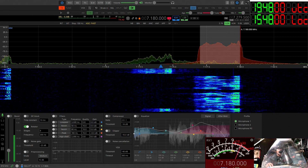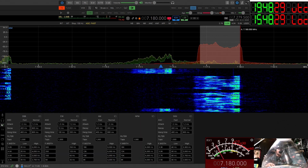I have it on video, but what I don't have is the numbers — you know how you set your audio from 20 to 3000 or 3500 — it doesn't pop up every single number. I'm trying to see if I can change that. What I'm going to do is go into my receive and change it to 3.5 to see if that even comes close. I transmit at 3.5 myself sometimes, especially on 40 meters when it's not crowded — I like to transmit 4k wide because it sounds really good, but if it's crowded I go back down to 3.